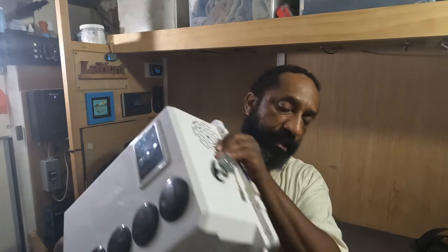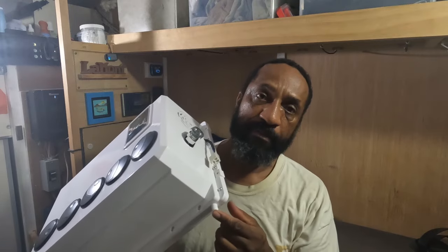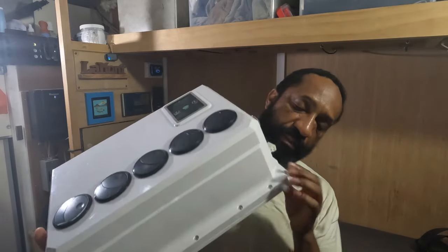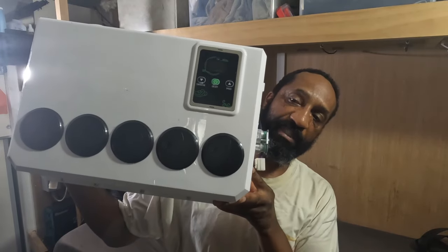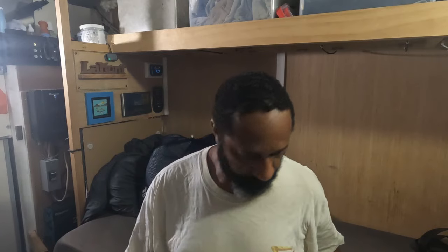There is a drain tube like right here. They put two of them, but this one's capped, so this is the one that I guess we'll be hooking up to, and I'll make sure the unit is tilted just a bit to make sure the water heads over to that section of the air handler unit. Let's see,